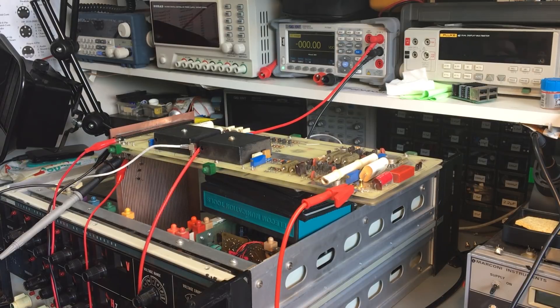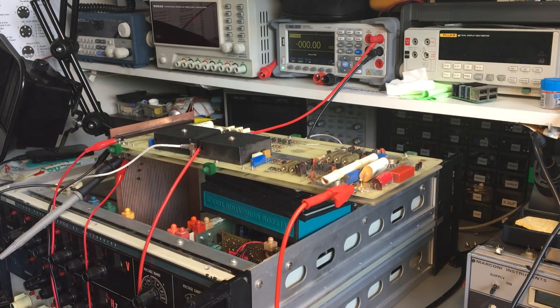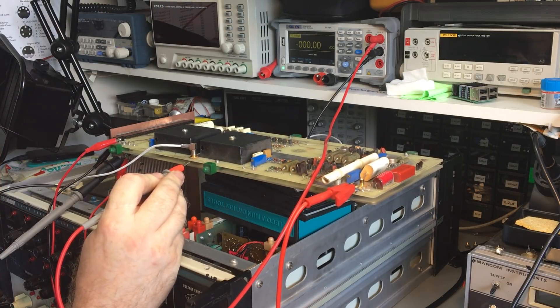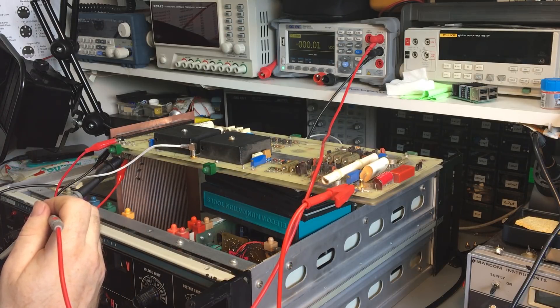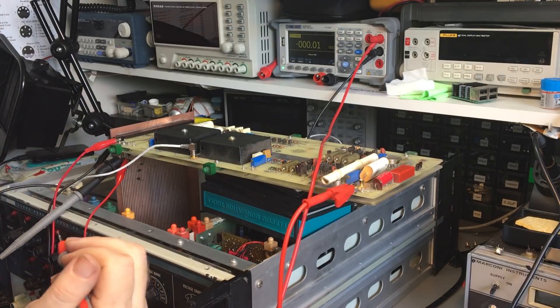The next step calls for a T-piece to intercept a signal line for measurement. I've ordered some but they haven't arrived yet. My workaround is that with the board in the assembly, I can physically reach and touch the terminal directly to measure it. I've ordered the right parts for future use. I need to verify I'm on 1 volt at 1 kHz and measure in standby mode after warm-up.